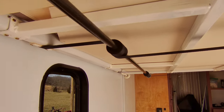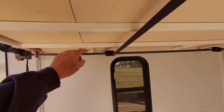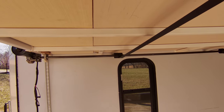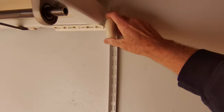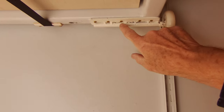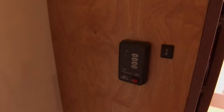Over here I have some half-inch PVC pipe — I cut it in half and just screwed it to the edge here. It's real slick and the strap just goes right over that. You can see how it winds up. I didn't put any guides — the Brendan fella had guides on his, but I didn't see any need for it. The straps wind up just fine. The tracks here are just Rubbermaid shelving track that I bought, and these are three-inch garage door wheels. In my design you have to use the three-inch — you can't get by with a cheaper two-inch. I made these custom brackets here. The switch on the wall is just a pivoting momentary switch that changes the circuit, for up and down.